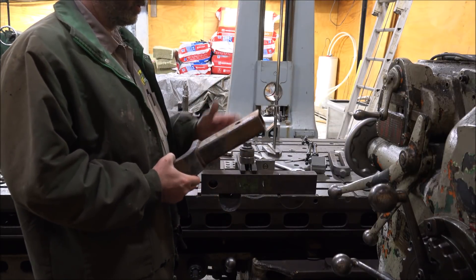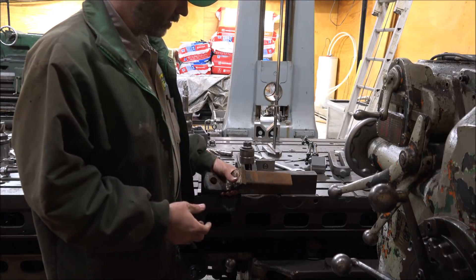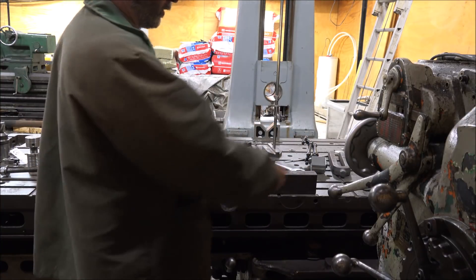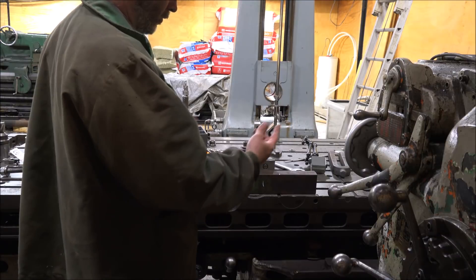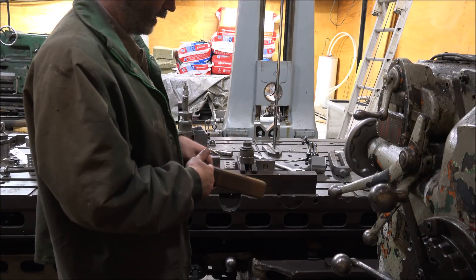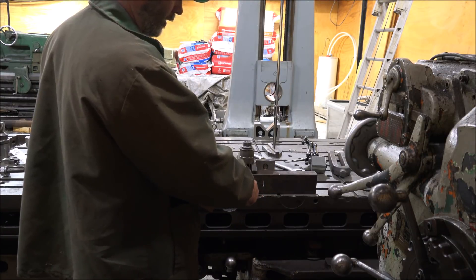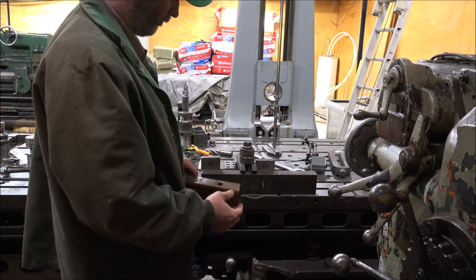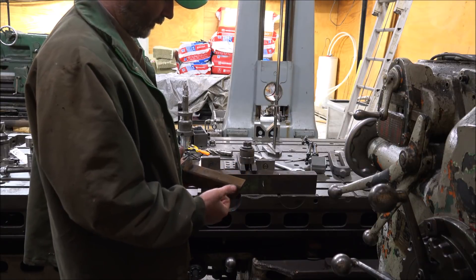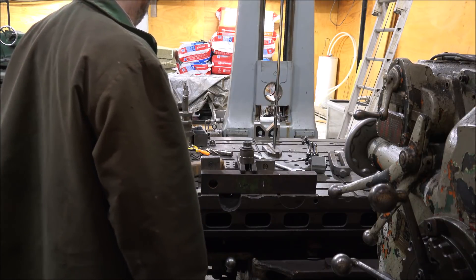Basically what I'm trying to do is to roughly mimic what's going in the receiver here out of this drawbar. It's too wide, but the thickness is okay. So what I do is come in here and do one side, then unclamp it, rotate it, and mill the other side. I like to have a nice radius in it. At a minimum, I've got to come this far, and then I've got to drill two holes in it. I'm not sure if I'll start with milling or drilling — probably drill it first. No point in milling if I mess that up. I'm sure I can drill a hole in the right place.